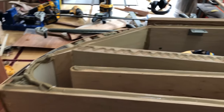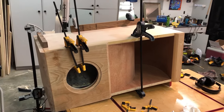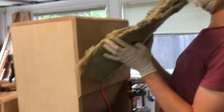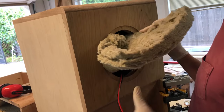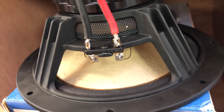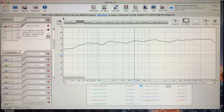You can do some testing by clamping the side first and listening to the speaker, then deciding what kind of stuffing you'd like in between — when you're happy, you can close the side. Some acoustic insulation was put inside especially on the back wall, which is a critical point where vibrations will be slamming the most. Ten-gauge speaker wire was soldered in — better than any connectors. Then we took it to the listening room with a calibrated mic and software and did many sweeps and tests. The frequency response is actually pretty good.